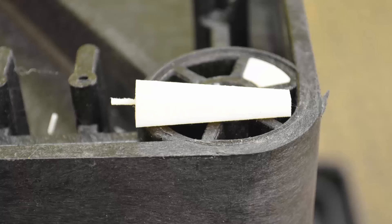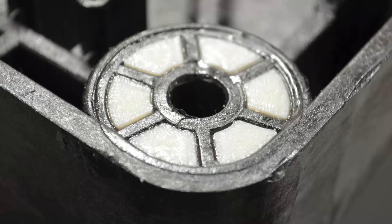For the remaining three corners we used six wedge shaped pieces that we also designed inside of SOLIDWORKS to place inside of the holes and use the epoxy to affix those to those holes. That completes the repair of our cart. Now we have a nice functioning cart.